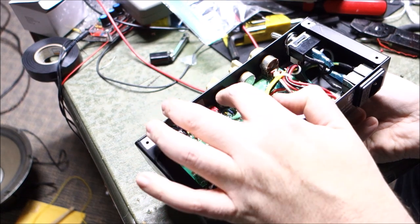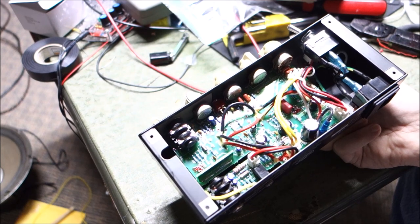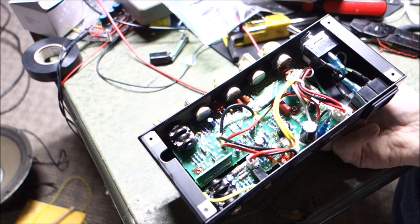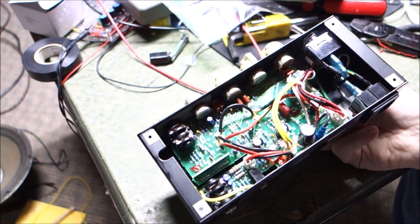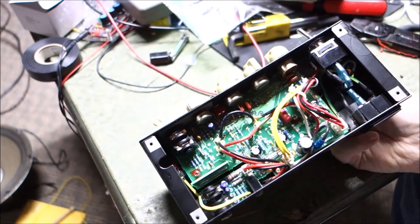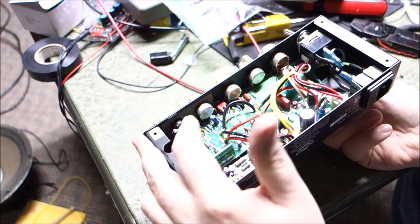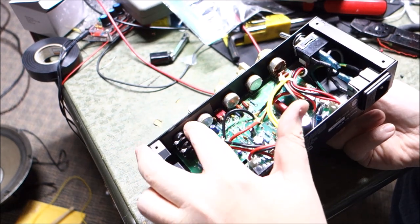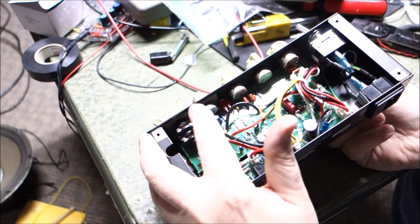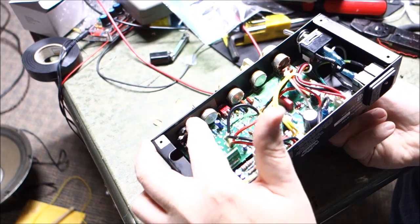The pots here have a Delta logo on them, so I think that's actually the manufacturer. The gain pot was a little on the scratchy side, which would obviously really impede signal getting into the amp if it wasn't clearly passing through — since that's your first stage. We used some Max Pro product to clean that up and it's working okay now. You can also see they have tape here to keep the pot from grounding to the chassis, which is interesting — they float the ground on the input jack, probably to reduce noise.